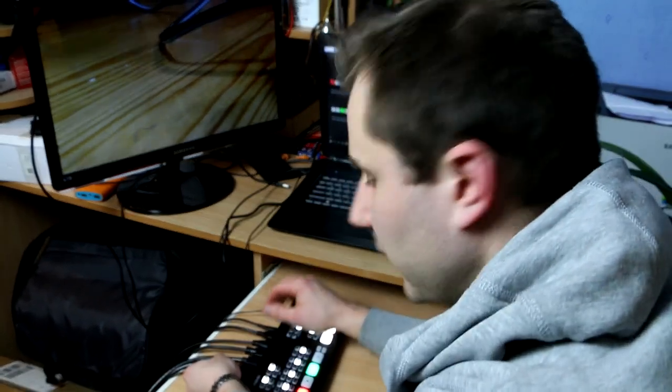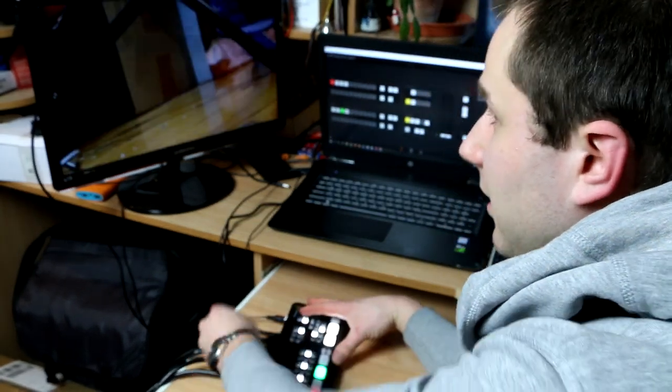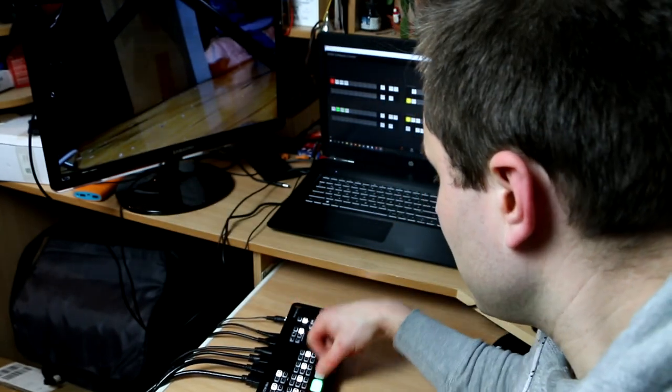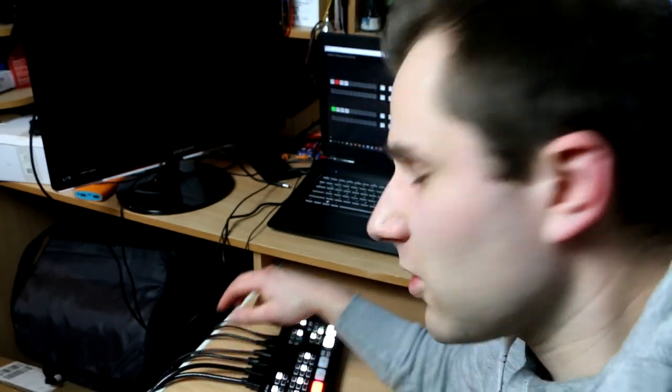And I was using these two big cables. So I was quite sure that probably there is no fault in the cable, probably something in the software, or I've put something in settings that shouldn't be there. So the next thing I wanted to try, before I start worrying too much, was to switch the cables. I take one out and press this one into channel 1. And as you see, the input changed, and I see the camera 2 input in the camera 1 slot. And when I change these back in place, there is no signal at all, and this means that the problem probably is not in the cables themselves, but something in software.